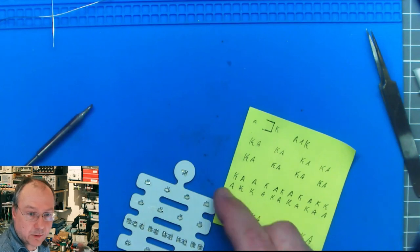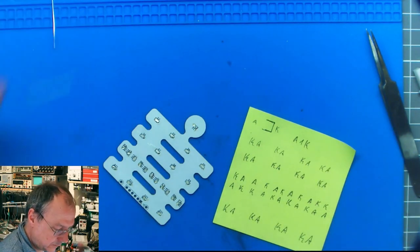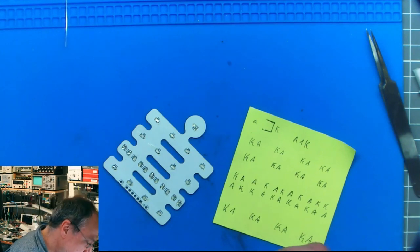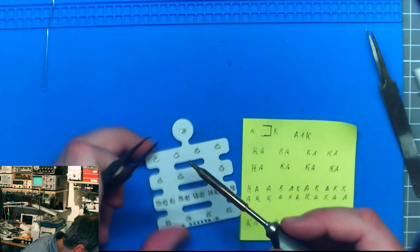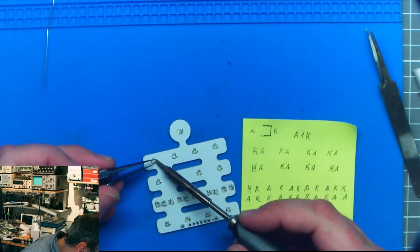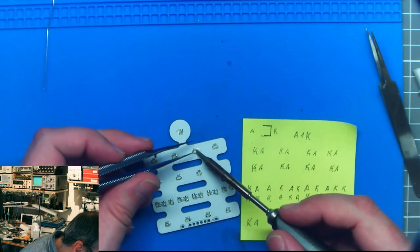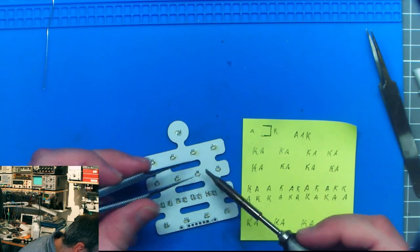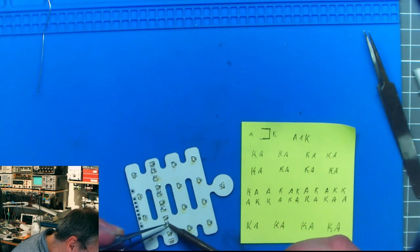Now let's try to fixate them. First, I have to wake up the soldering iron again and put some new fresh solder on it. Like this. And let's start with the LEDs up here. Okay, number 1, number 2, 3, 4. Now we're refilling the solder there, and pressing them down in order to make sure they're flush on the circuit board. And here's the last one of the red ones, like this.